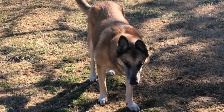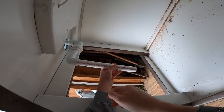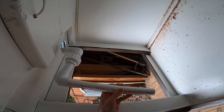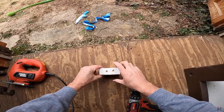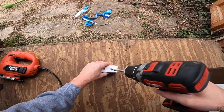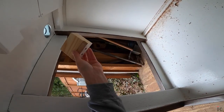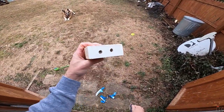Now when the overflow pipe is installed, there's 3 and 2/8 inches from the top of this ceiling and the top of this. So I need to cut a bunch of pieces of wood to make a bracket in here so that this can fit on and be screwed to the top of the cabinet. So what I did is I took two pieces of wood, cut them to length, drilled two holes, countersunk those two holes, and now I'm going to drill these into place. Now that's my riser — it's going to go right here. So I'm just going to give this a little sanding and that's going to go straight to paint.